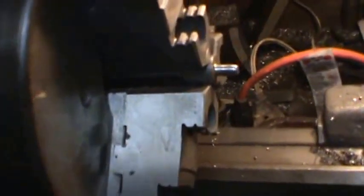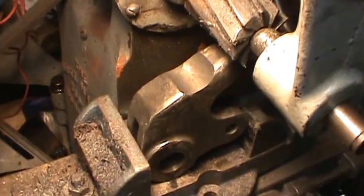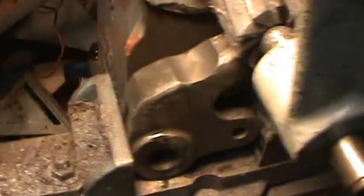Now I can just clean it all up, put it back together, and I'll see what I can clean up here. Next little modification. When I tried to shift these arms one-handed, especially this one, when it's up inside there, I pull it down and these two lower places here just wouldn't go in, because you can really see there it hit the bottom. So what I did was hog a big chunk out so it misses the bottom of the lathe there. I've put the shaft in it, and it all works really good.